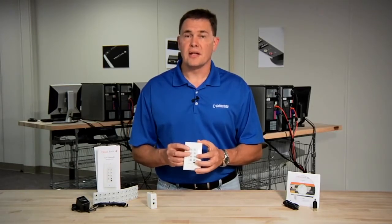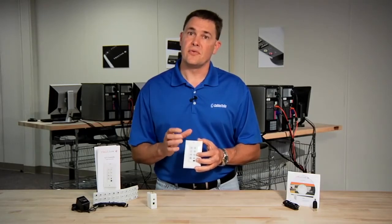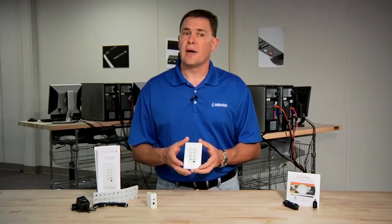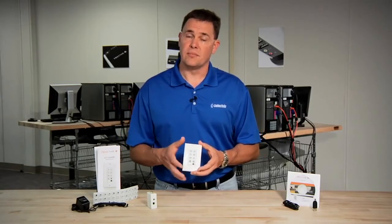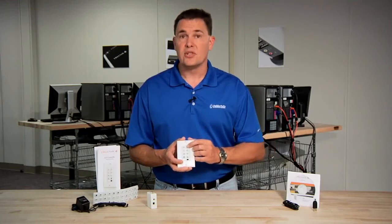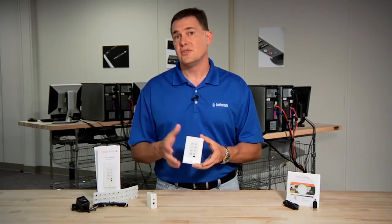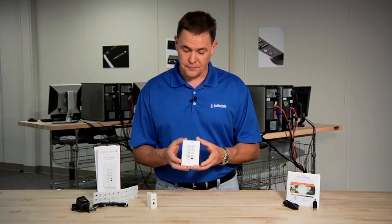With the fire all command, that will fire all commands within the stack within milliseconds. And the best example of that is the power off. Typically the power off on a projector requires 2 button pushes to confirm that you want to turn it off. What you can do is you can program in the off button so it'll fire off both commands within milliseconds, so you can turn off the device at the push of 1 button.